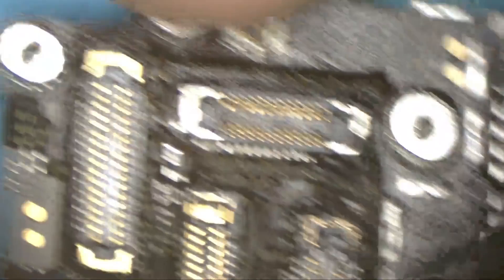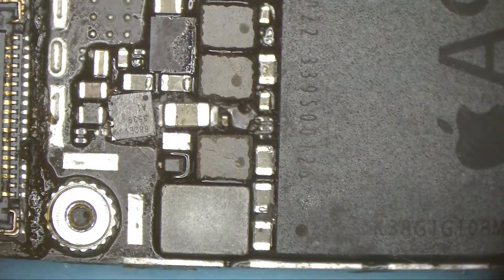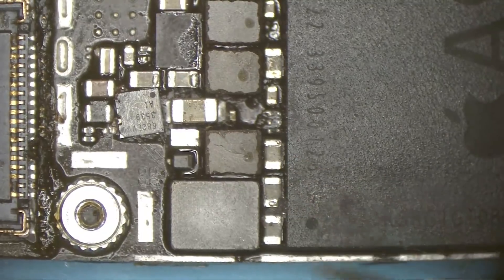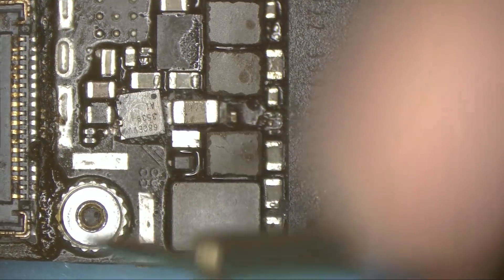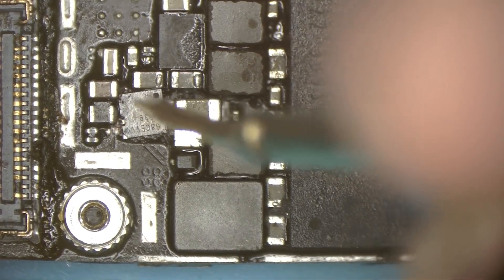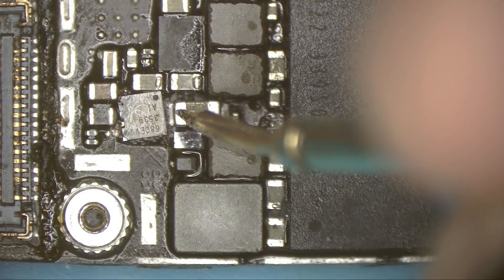I see here there is no filter, and I see this coil is actually broken. Let me check diode mode for the VCC main — I know I don't have a short on VCC main, I just want to check the value. It should be about 300. It's 500, which is too much. Let's check the backlight circuit — it's 500 also.